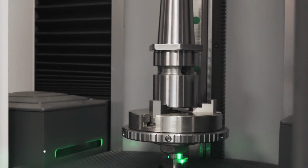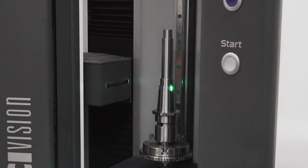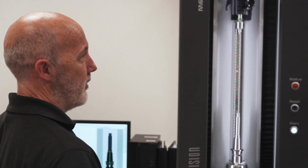Previously we used to measure them by hand using verniers, micrometers, height gauges, that sort of thing. You know, when you work into the degree of accuracy we're talking about here, it took a long time. It wasn't always accurate and a laborious process. So given the volume of parts that we have to measure to that degree, it was a very slow, painful process, and it actually created quite a significant bottleneck in the business, most of which has been eliminated by the Vici system.